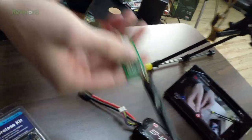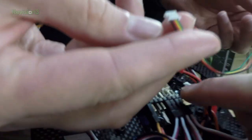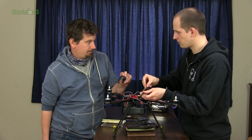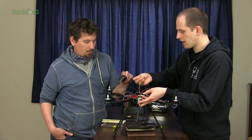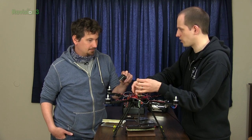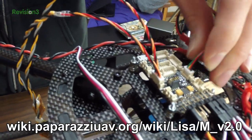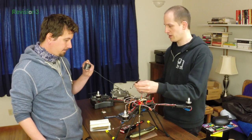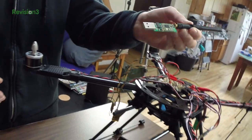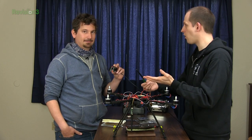So where does this guy go? We have a pigtail here. Hobby King sells them already with a Molex connector — specifically PicoBlade, which is the brand/type of the connector. You can find pre-crimped wires and housings on the internet, and everything is documented in the wiki. So we just plug it in here. The other receiving side would be a USB dongle like this — we plug that into our computer and our ground station will receive the telemetry from here. It's very similar to when we had it plugged in USB — it's a wireless serial cable, like USB through the air.